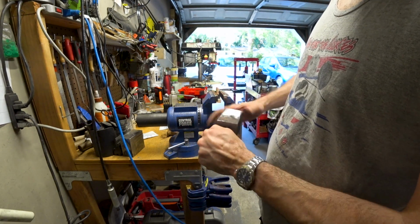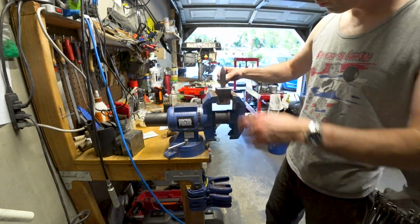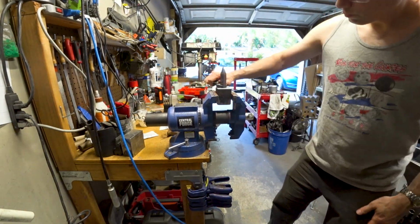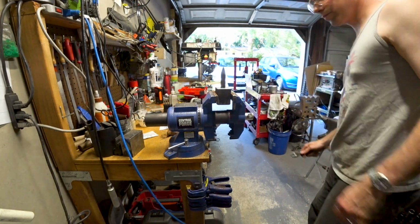There's not much left other than to thread the two pieces together and then tighten them down. Since the rail spike has a square cross section, you can easily get an adjustable wrench on there to tighten it up. Torque it down pretty tight to get the most strength out of the joint. Use a little thread locker if this is your final assembly.